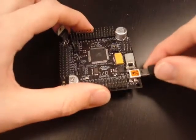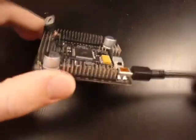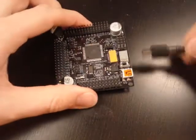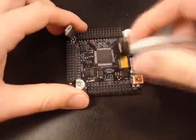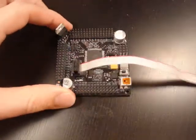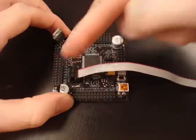It already has a USB connection like the original Axon — it just plugs right in. It can upload programs or download data very simply. You could also connect a hardware programmer; you don't need one, but it goes right into the ISP connection right there. The wire just goes straight across.